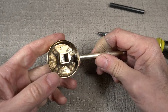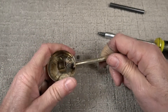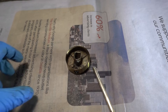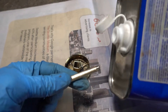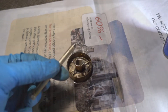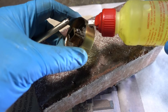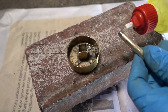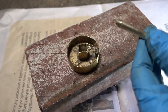Got a nice tight fit in there. The stem goes all the way down through the boss, and you don't want any looseness — soldering cannot be used to fill voids. Degrease the parts with some acetone, then put some flux on the parts. Careful with this stuff; it's a strong acid.